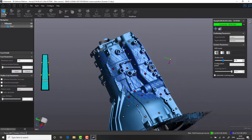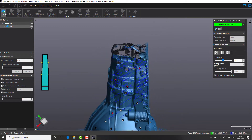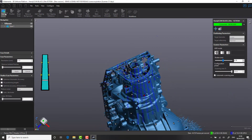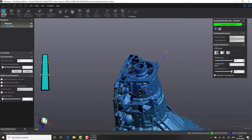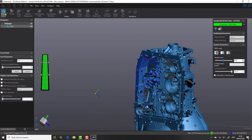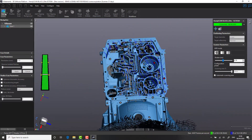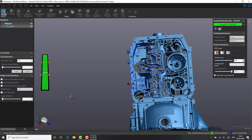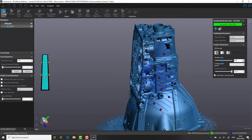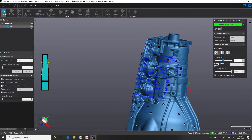In this section we are 3D scanning a rough casting of a transmission casting which requires 3D inspection before moving on to the next manufacturing process. 3D scanning is more than just an ISR tool — it provides quality assurance throughout the process of manufacture and allows you to capture defects or changes in your part or process at the very early stages and throughout your entire production process. It is important to recognize that the technology you utilize in your inspection workflows is traceable to national standards and meets your own internal ISO requirements.